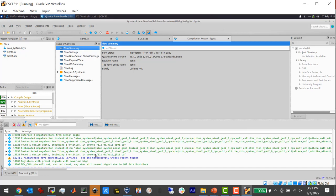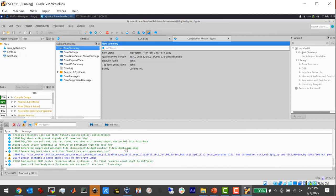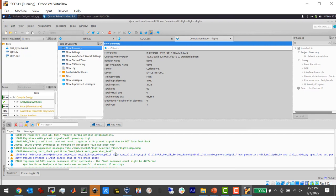On Wednesday my plan is to give you another tutorial on how to add components needed to talk to the lights on the board — to actually make it blink lights. I don't have time to do that today, but I'm going to give you enough to print hello world. It's also taking a little longer here because I'm running a virtual machine on top of Windows. In the lab you're running Linux natively and on desktop computers, so it'll be faster. Compiling FPGA designs in general does take a while. Now I'm going to show you how to actually configure the FPGA from the command line.